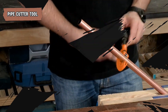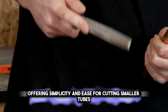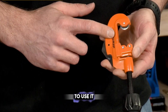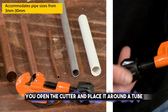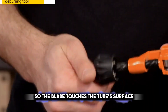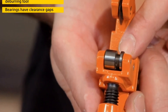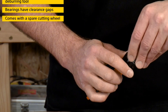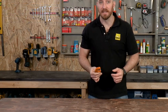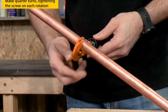For more focused tasks, the pipe cutter tool is the go-to, offering simplicity and ease for cutting smaller tubes. It's small enough to hold in one hand. To use it, you open the cutter and place it around the tube, then tighten it so the blade touches the tube's surface. As you twist the cutter around the tube, the blade makes a shallow cut called a score. Each time you go around, you tighten the cutter a bit more, making the score deeper. After several turns, the blade cuts all the way through the tube.